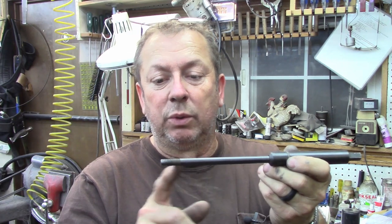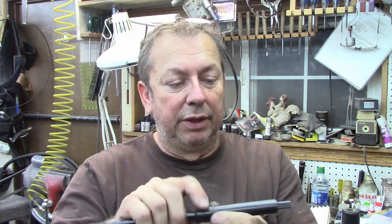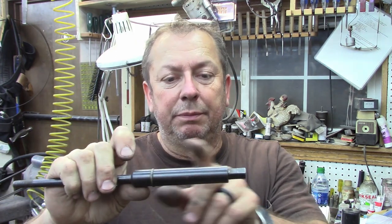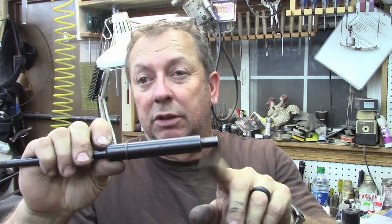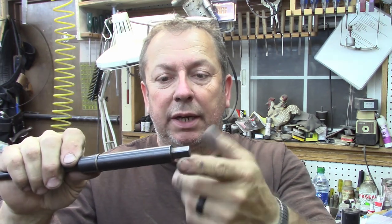And I'm going to turn it down a ways. We'll thread this inch and then we'll go back and do our final turn for the rest of it. Then we'll pull it out of there, make sure we've got our length right from here to here. And I'm just going to probably use my spin indexer. I'll set this up in the spin index on the milling table and cut it down so we've got a 3/8 inch shank on the end. That's all there is to it.